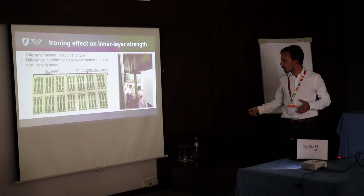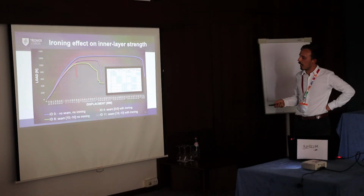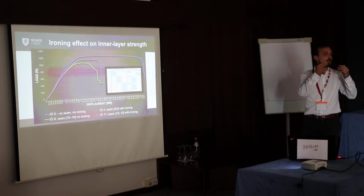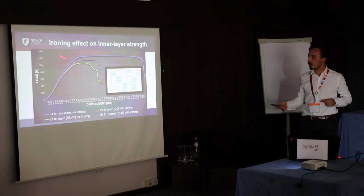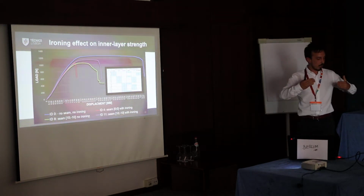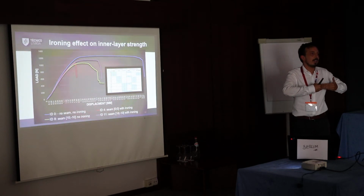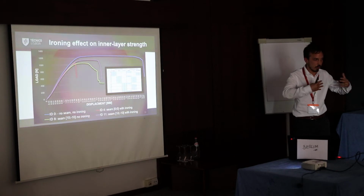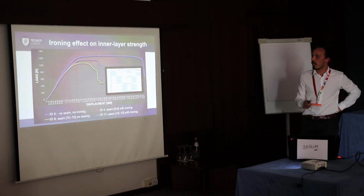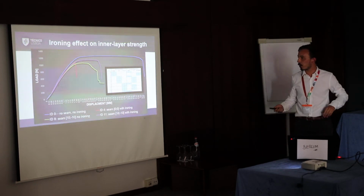This was the first thing we noticed, but an interesting summary, I guess, is this. In blue you have a normal specimen produced by one extrusion module. Then if you have two extrusion modules and you simply do the minimum overlap, even if there is necessarily an overlap or you wouldn't have a specimen, you end up with a type of brittle fracture. So that's a fragility of your specimen.